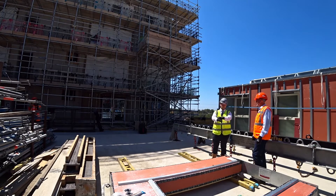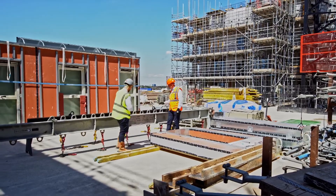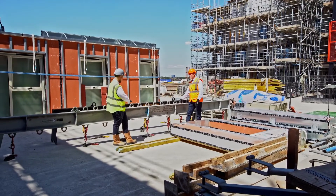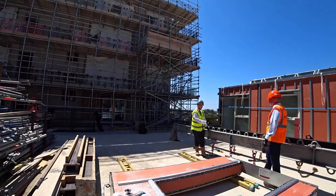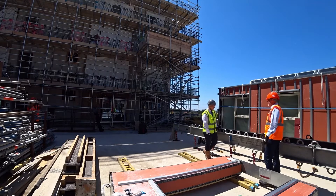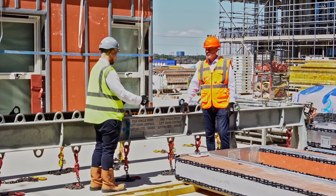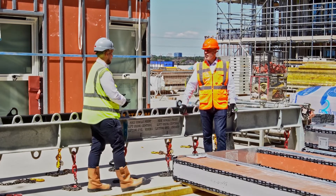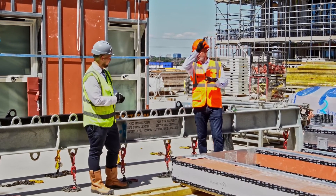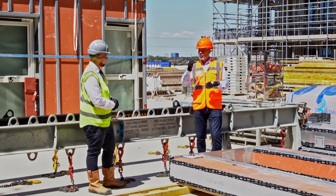Did they achieve the right workmanship? This just means that it's all dealt with in advance — factory-controlled environment — and it just reduces those on-site reworks. Behind us are the lifting rigs; this is what they're using for their picks. They're fairly standard lifting beams, they work really well on-site, and they have to be certified every six months. This is actually part of the service and package you would buy from British Offsite — you would buy panel, you would buy wall, we would give you the correct lifting equipment, which is normally included in the contracts. And we'll actually guarantee that air and sound tightness. So let's go up a few floors, check out how the panels are being installed, and show what the panels look like once installed in the modular concrete floor system.